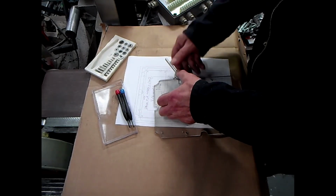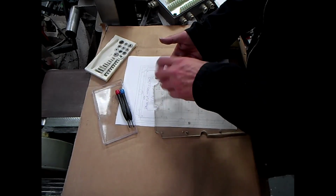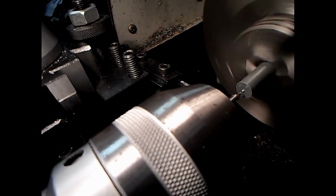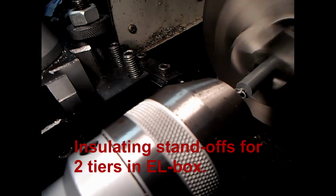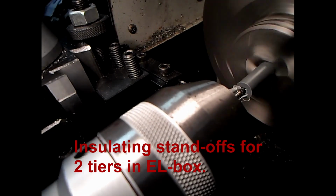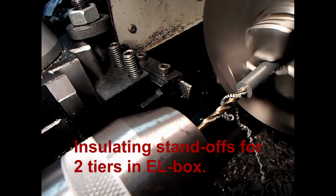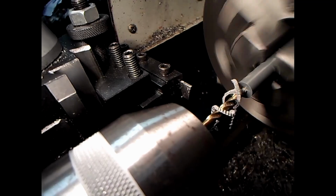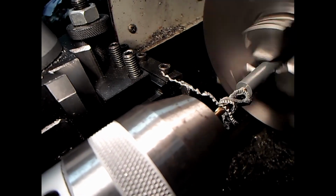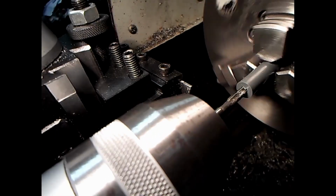The time it takes for the contact to hop from one contact to another while simultaneously instructing the controller to cut the spindle's power will not be an issue in terms of power glitches or brownouts, as will become evident should you listen on. The indicator on the button attached to the box emits a flash code indicating as appropriate. Elsewise, it communicates the values it is finding. A pause, then a stream of 8 bits, most significant bit first, as flash pulses.